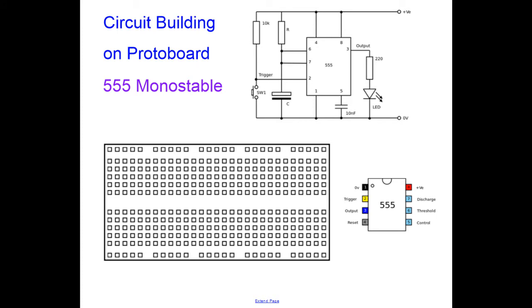Next is everyone's favourite: the 555 monostable. It's getting routine by now — we start by drawing the 555 chip, an 8-pin chip, in the center of the board. Draw the chip in, put the notch in, label it 555. Before going further, connect the positive which is pin 8 up to positive, and connect 0V which is pin 1 down to 0V.